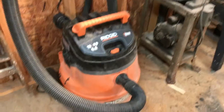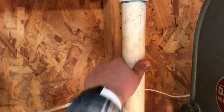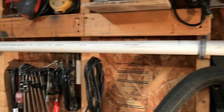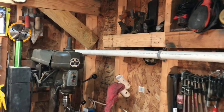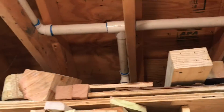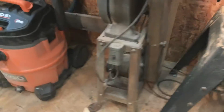There's a small step ladder someone threw away — I just grabbed a piece of wood on the end and it's good as new. I'm in the process of piping up a central vac system using inch-and-a-half pipe. I've got one lead going over to handle the drill press and workbench, and it's piped to go over to the other side and drop down as well.